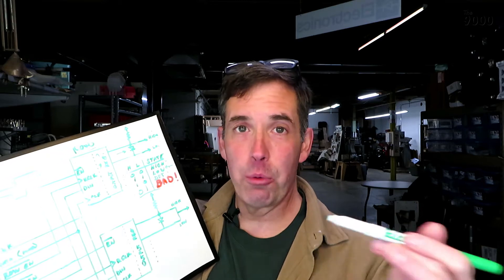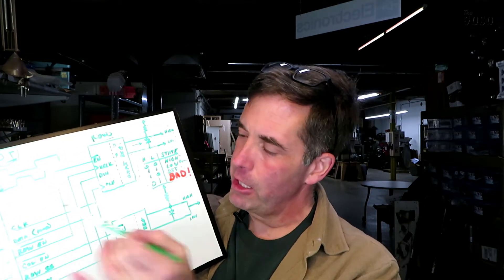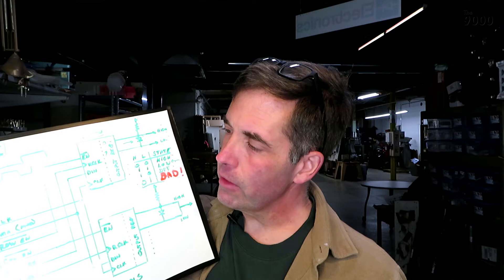What if you press the reset button? Pressing reset isn't too big a deal because at the beginning of every Arduino sketch, you configure all your GPIO lines as inputs or outputs — usually the very first thing in the code. These are all configured as outputs, none of them need to be inputs. So right at the top of the code I set all these lines to outputs, set initial state, and everything's fine. But pressing the reset button is not the only thing that causes a reset.